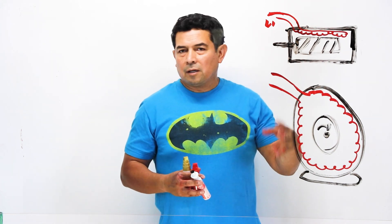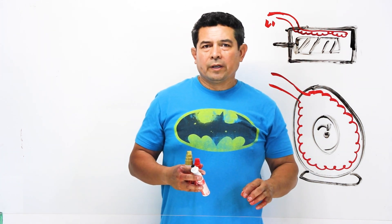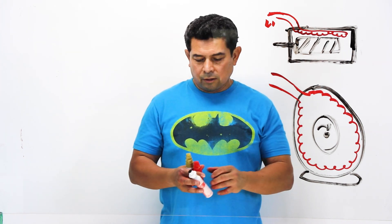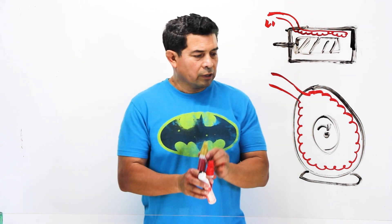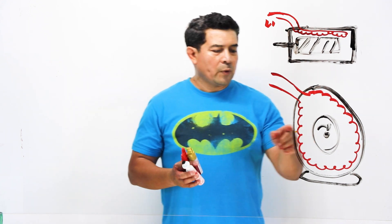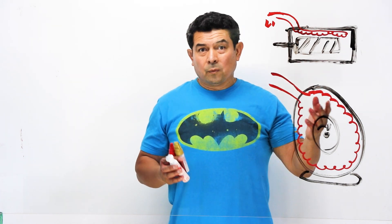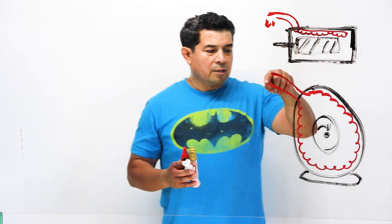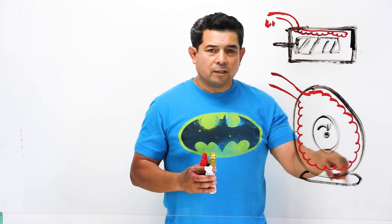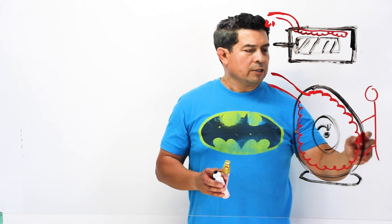So now we have rotation and we can make it do work. In a previous video I talked about what a short is, and in another video I talked about what a ground is. A ground is when there's an electrical connection between the windings and the casing. So now we have a connection, which means that electrons — the electricity as they come in — since electricity is lazy and wants to take the easy way out, it's going to go into the casing and go around looking for a way to get to ground. Let's say you come along and touch it.